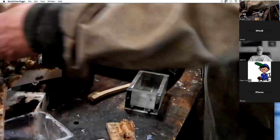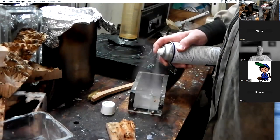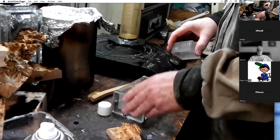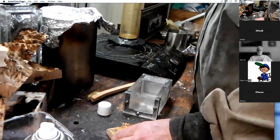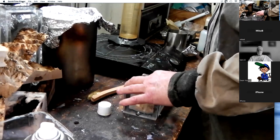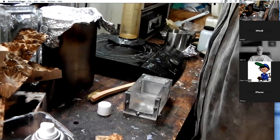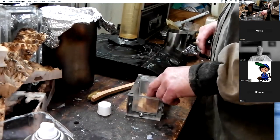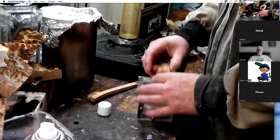The piece goes into the oven and it'll take a day. As far as the shelf life of the cactus juice — if you use it over and over again, what do you look for to say it's time for a new batch? You'll see that it doesn't harden as quickly as it should. With a new batch, if you look after two hours you'll see hard crystals on the surface of the wood. If it's losing its zip, you may have to wait six hours. Store it in the dark and cool — I keep it on the garage floor under the bench.